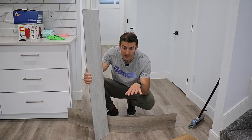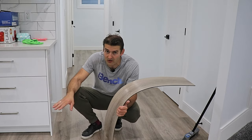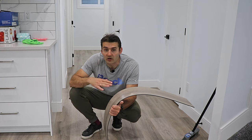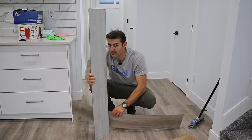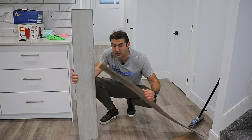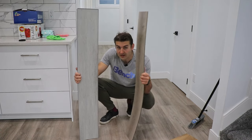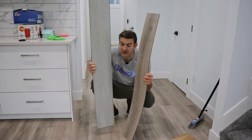If you want to go with a click vinyl, you really have to do an awesome job leveling out your basement, because concrete is poured roughly so the builders can move out and sell the home — they never level out the basement. That's why the best case scenario with the least headache down the road will be your glue down vinyl.